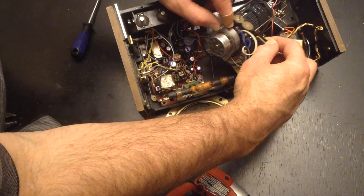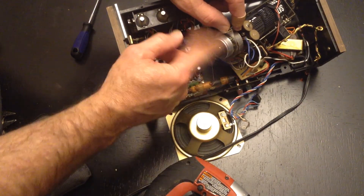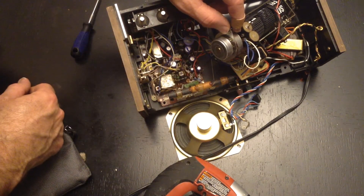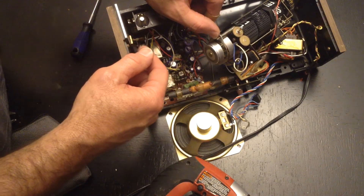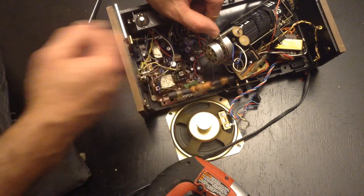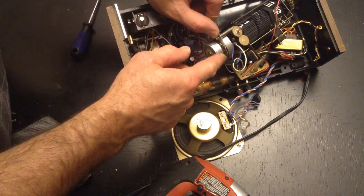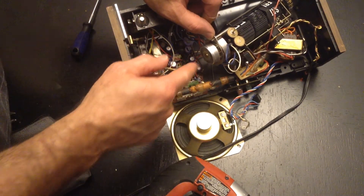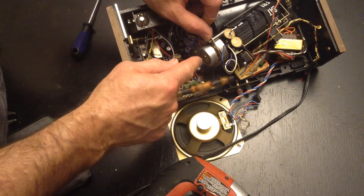You'll notice they turn counterclockwise, so if yours isn't moving at all, you want to start flipping it counterclockwise like that. What I think is going on with these clocks — after disassembling a couple of these motors — is that there's grease in the axle inside between two brass bushings that gets kind of hard after a while.